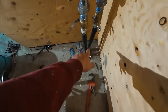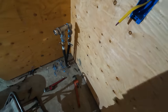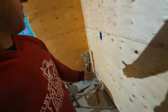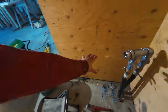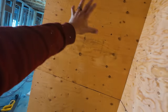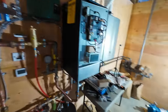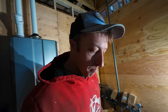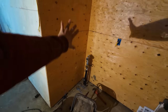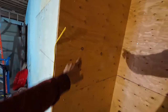I had to twist the orientation of the two water lines coming from the cistern. Originally I had the pump planned for one wall, but changed my mind — I want the pump on this wall because the other wall is going to be the water softener. The pump will be elevated here, pressure comes up and over into the pressure tank on a big shelf I'm building. It'll also feed across into the water softener and then one-inch PEX across the house. When the plumber is on site he'll figure out the exact layout for the potable water. These walls are solid — three-quarter-inch plywood with ICF — I could hang the whole tank on there no problem.